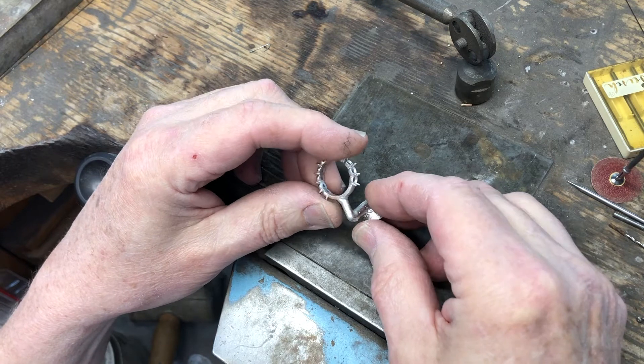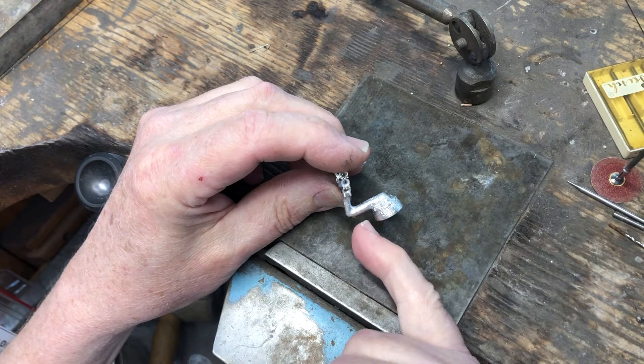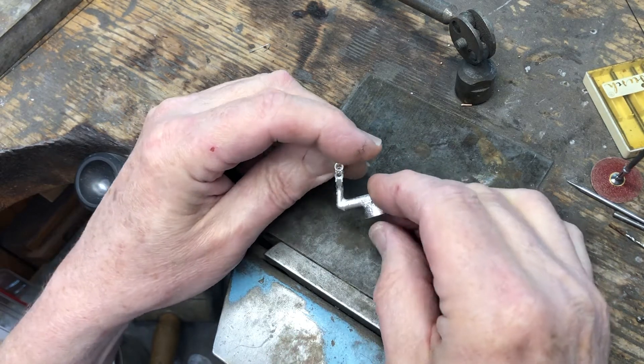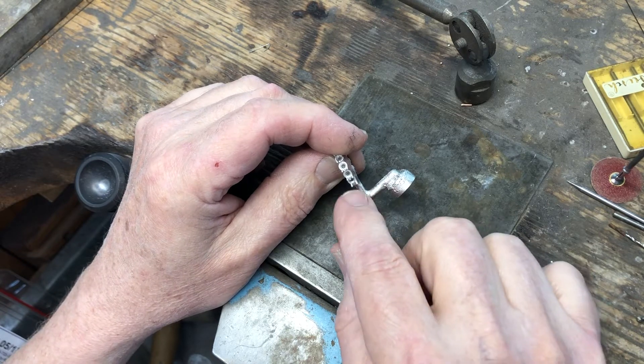The way that I figure out how I sprue it: this is number 10 gauge, and this is number 8 gauge. So you're working with heavier sprues when you cast platinum. Also, platinum loves a right angle.